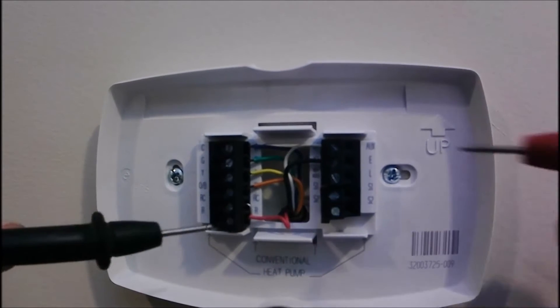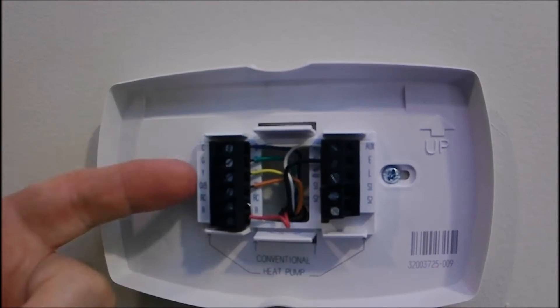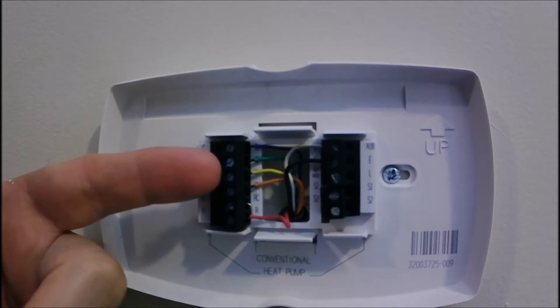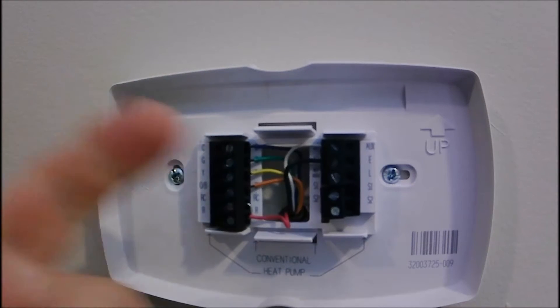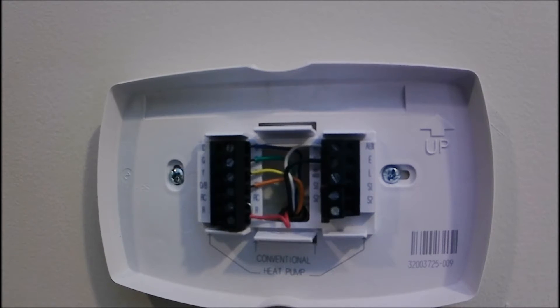We got a broken yellow wire — that's one check. We've proven that the yellow wire is open; it did not beep when we touched that screw to the red. We're going to use a spare wire for that, but first I'll show you another way to use continuity — checking for no beep. Right now all the wires were touching on purpose via the wire nut. Now we're going to do continuity again with the wire nut removed, so I'll go pull that wire nut back off and recheck.